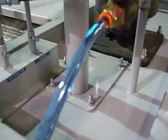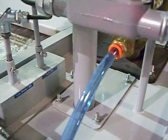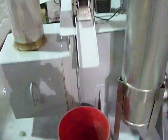Your inlet is right here — this is where you'll have your plumber connect your fresh water source to the system. There are drains at the bottom of the rinse tank and back over here on the wash tank. One note on the skimmer: you can set a 5-gallon bucket or whatever size bucket directly underneath to catch the oil. It can also be equipped with clips so that a 5-gallon bucket can hang from the skimmer plate.